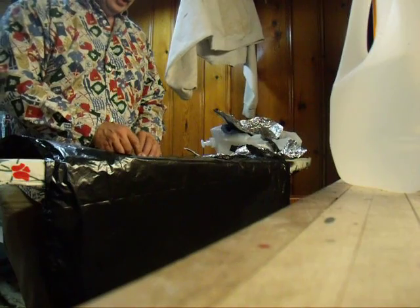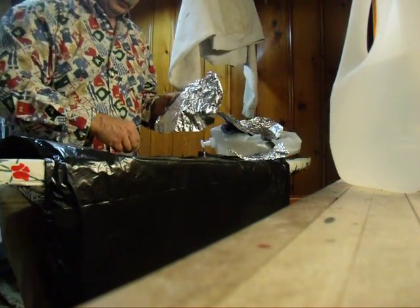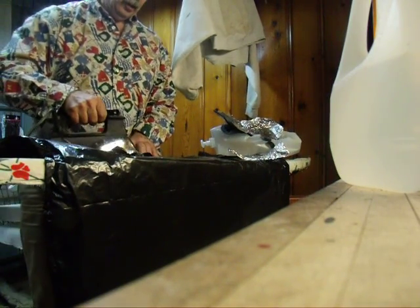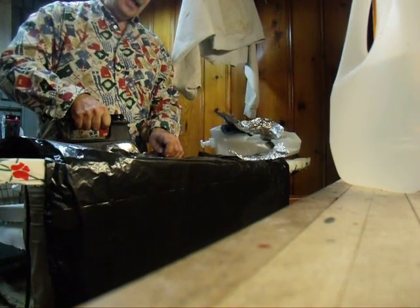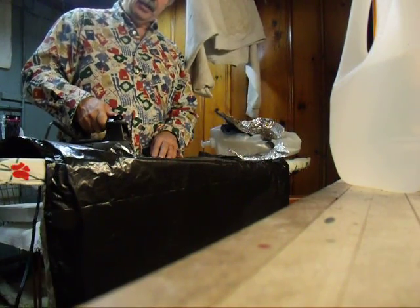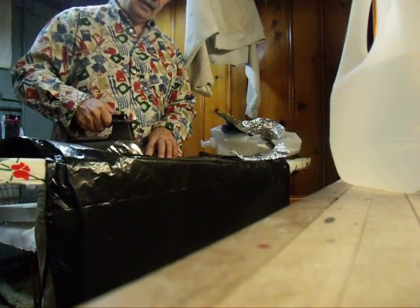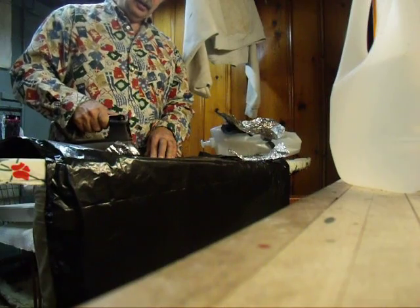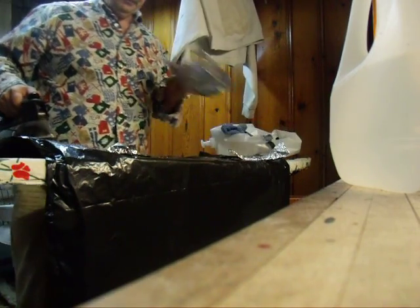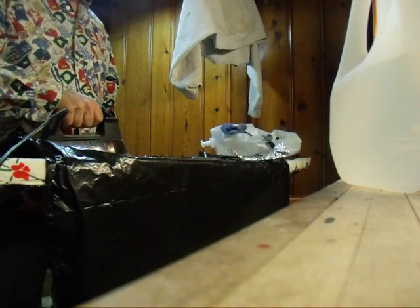What you can do is lay this piece here — which is cut out — down, and then use the iron to heat seal this high density polyethylene to the low density. You have to do both sides because this is a much higher temperature material than the low density polyethylene used in the bag material. Typically they add some ethylene vinyl acetate (EVA) for low temperature impact resistance, and a lot of polyethylene materials have EVA — especially like freezer bags — otherwise they just split and break in the cold.